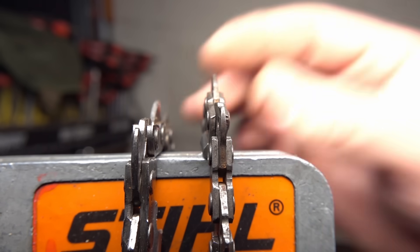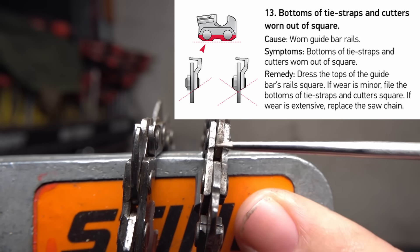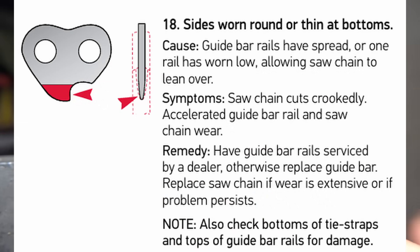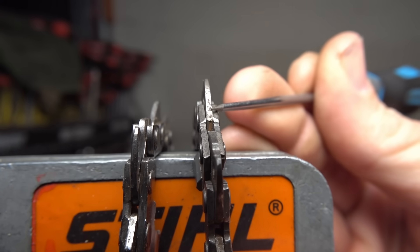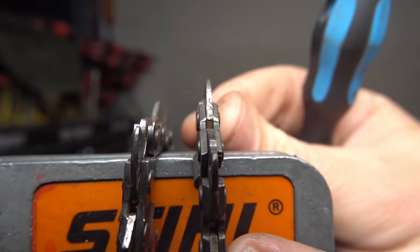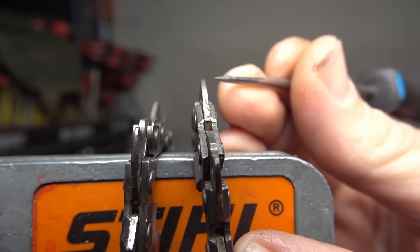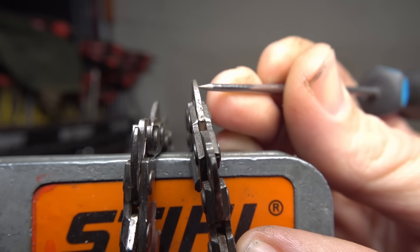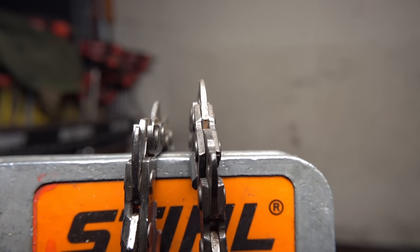The next part is really difficult to show. Here we have some chains turned inside out. All that lower wear you see from the sides is due to the tie straps and the bottom of the cutters running across the bar rails. We also need to look at the condition of the actual drive link from the underside. In an ideal world, these should maintain the same thickness from the bottom of the chain to the very tip. When they become dull or are sharpened incorrectly, the chain wobbles in the bar groove from side to side, creating a tapered shape — thinner at the end. If someone is better at sharpening one side than the other, the links will wear heavier to one side.